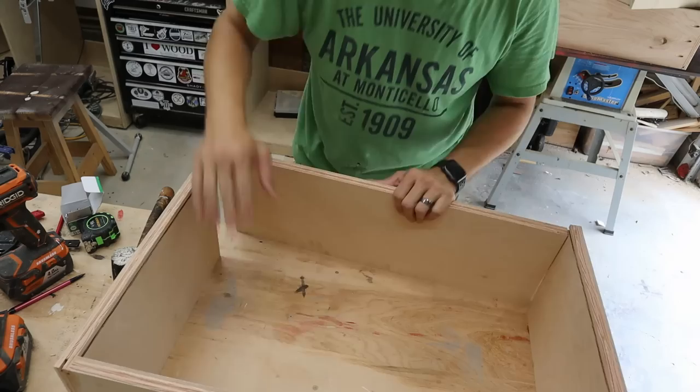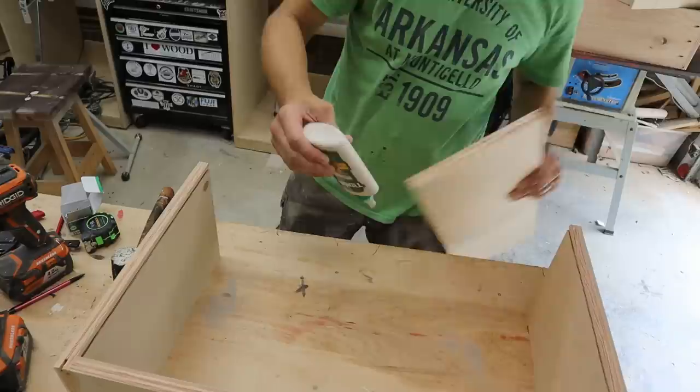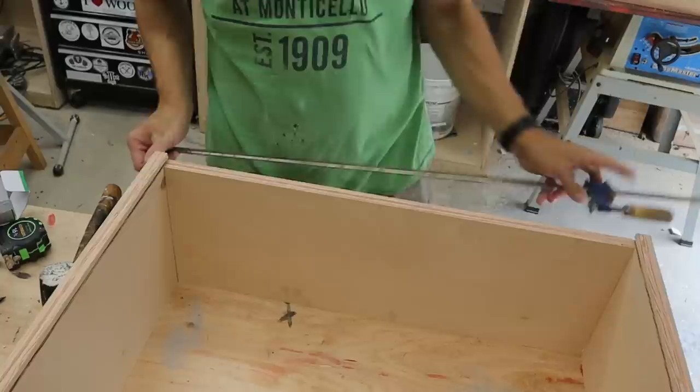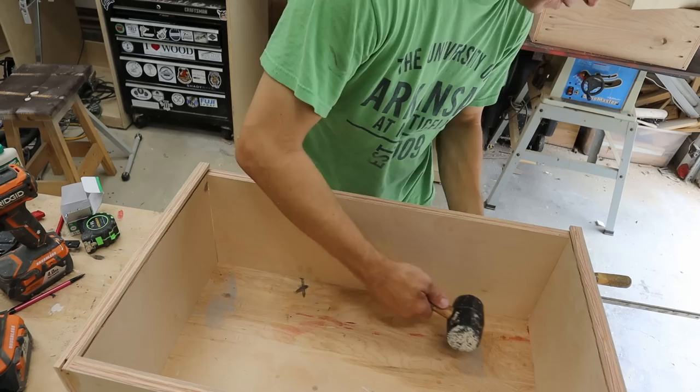I try to keep the dust and trash debris off the table, that way nothing gets moved or there's not something under there, it makes everything kind of go off kilter. Now I'm using Tight Bond 3, you can use 2, Gorilla Wood Glue, whatever you want. So I just kind of put it in place. Pretty close. This is an Irwin 36 inch clamp. All these tools and supplies, I'll put a link in the description for you. Just a light snug at first. Rubber mallet. Get everything flushed up on this outside.